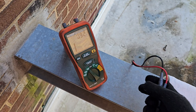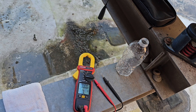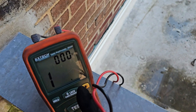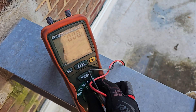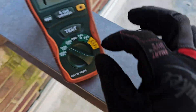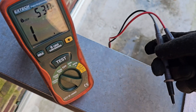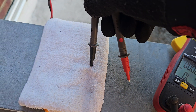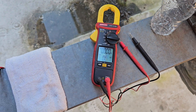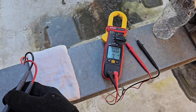Let me stop that. I could go to 500 volts — but you see the difference, right? That standard meter was saying we have a high resistance: like 2,500 K-ohms or open circuit. But the megohmmeter at 500 volts output shows zero megs — even though that meter was giving me open circuit and really high resistance like 2,500 K-ohms. It's just crazy. That's the difference.